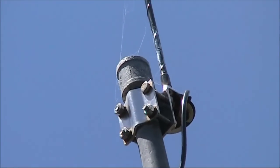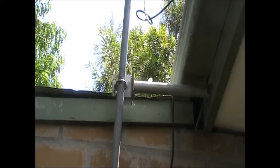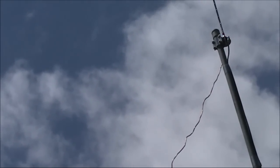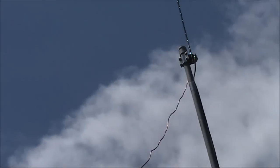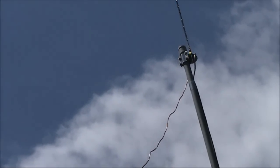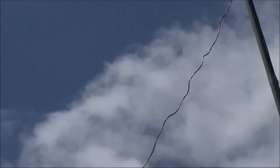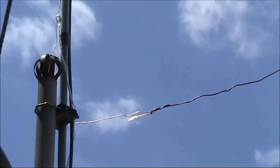The antenna is mounted on a piece of pipe, about four or five meters high. Ground plane antennas normally use three or four radials, although strictly speaking you only need two. I'm being even lazier and using only one, though be aware that will skew the radiation pattern. The radial used is fairly thick insulated wire, around 2.6 meters long, and that's tied off at a handy point.